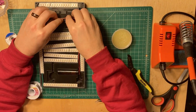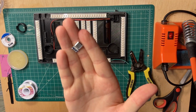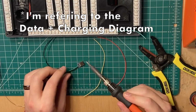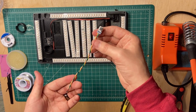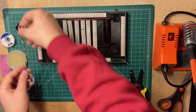After I was done with the battery and kill switch, I moved on to wiring up the 3 chips to add USB-C charging and data to the CFX install. When you look at the diagram, you'll notice that one of the chips is a micro USB connection that takes data straight to the board, while the other chip allows for power to pass to the board.